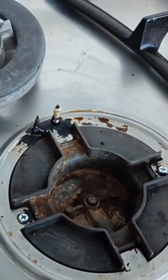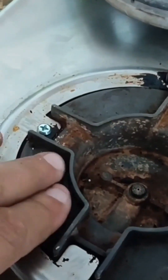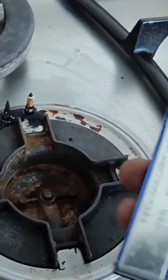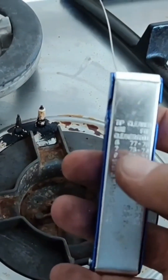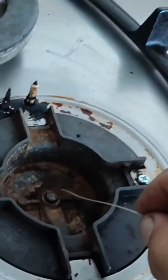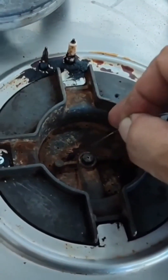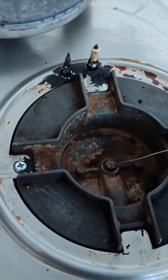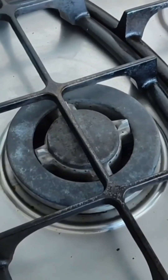We're going to replace the screws so it'll be completely attached, and now the correct amount of oxygen will flow in. We're also using this tool called a calibrator to unclog acetylene nozzles — it has a bit of sandpaper or a file and we're going to insert it very carefully. Don't overdo it by going up and down too many times or it'll end up leaking too much gas.